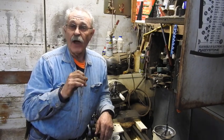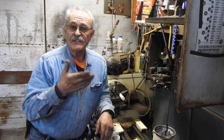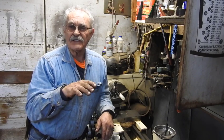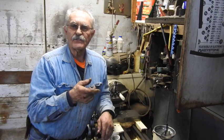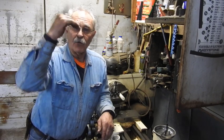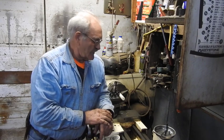I'm going to use some of that round stock, that UHMW, and I'm going to machine it down to where it fits the bore, just an interference fit above the diameter of the bore that we just cleaned out. And we're going to go ahead and press those in and use those for bushings, and that way it'll run nice and smooth on the bolt and everything that's going to go through that fancy looking little horseshoe bend that we're going to be rolling the doors with.